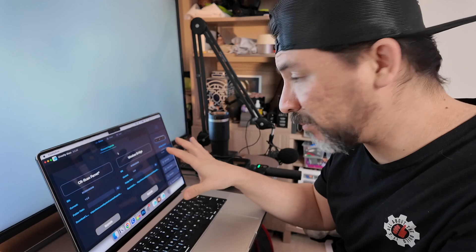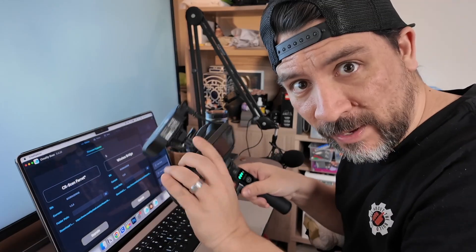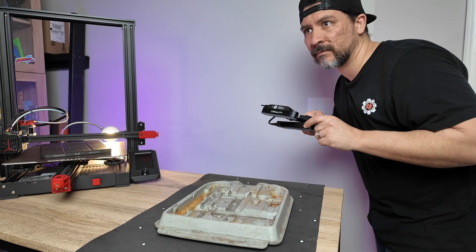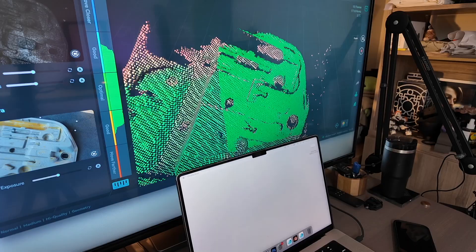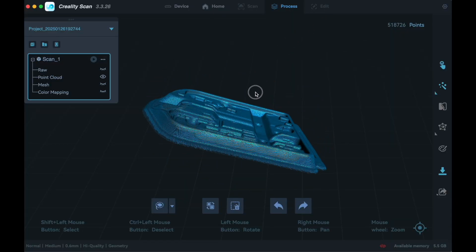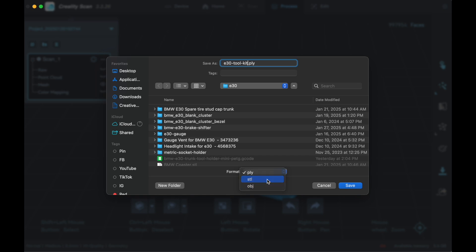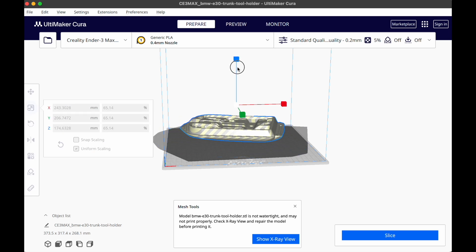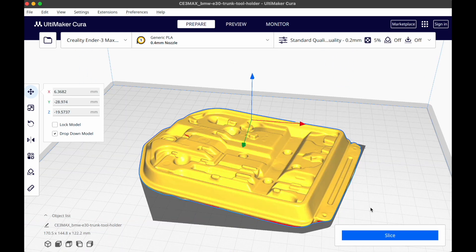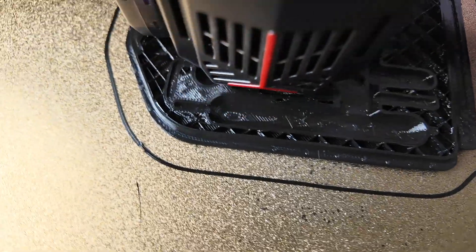I was able to get my laptop to connect directly to the bridge, so I'm going to detach my phone and load this up full screen to see across the room and give it a try. The wireless scanning to our laptop is actually working pretty well. Creality Scan on a MacBook just has a cleaner interface. Once done we deleted all the unwanted parts just like we did on the e-brake handle. We then export the STL into Cura — our printer is a bit too small so for this prototype we'll shrink it down, give it a good slice, check the layers, and print with some PETG filament.